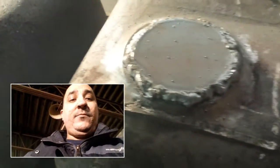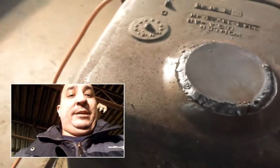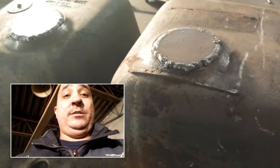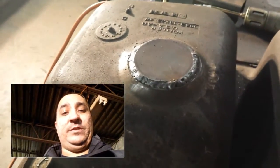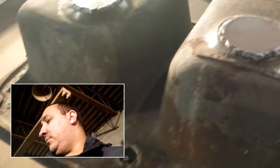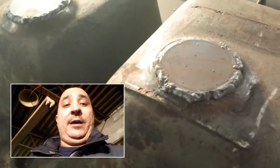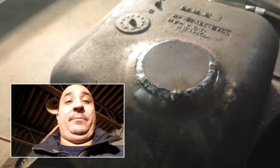The only thing I'm looking to prevent is cracking where the cap could come off. I'm going to let this cool down a little bit, heat it back up, let it cool down, heat it back up — just keep going with that cycle. If this does not work, you'll see more to this video; if it worked, this is it. That's ER 70-6 solid MIG wire. Not using any special gas. Do not recommend this for anything structural whatsoever — this is simply just to plug a hole.